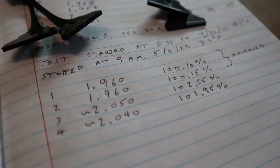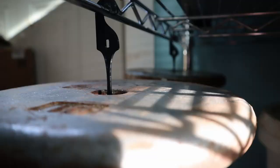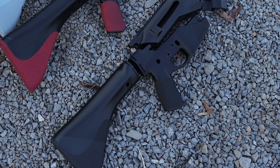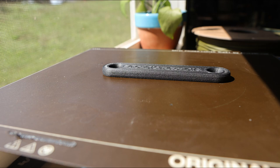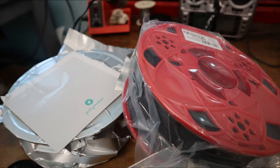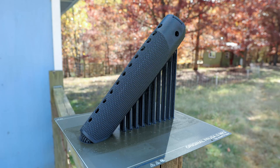Creep is a plastic deformation at stress levels significantly below the yield strength of the material. I have not yet done any creep testing with the PA-12, so I don't know how much of an issue it is. I did observe some possible creep issues around the buffer tower on my Orca build, but this is inconclusive. With other nylons I have tested, creep was a huge problem until I annealed the parts. Whether or not this is a problem with PA-12 will be very interesting, especially with the added possibility of elevated temperatures allowing creep. High fiber content PA-6 nylons, despite their poor surface finish and lower impact resistance, are still going to be the best option for high temperature applications.